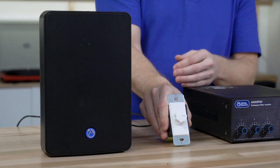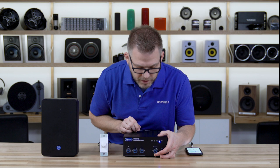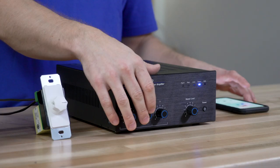We want to work our way backwards from the speaker to the amplifier to give it the best chance of working efficiently. Set your local volume to three quarters of max — that gives you a little bit of headroom to bump it up. Make sure your tap setting is set according to your instructions, then set your master output at three quarters of max. You'll see you won't need nearly as much input gain to get the same volume output, and that'll help keep you from clipping and peaking on the amplifier.